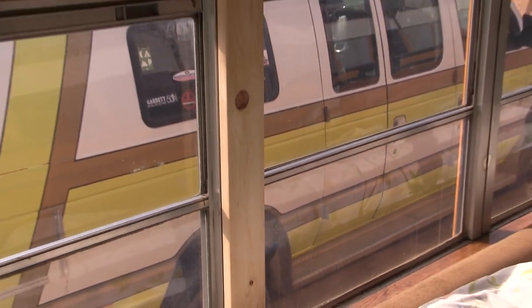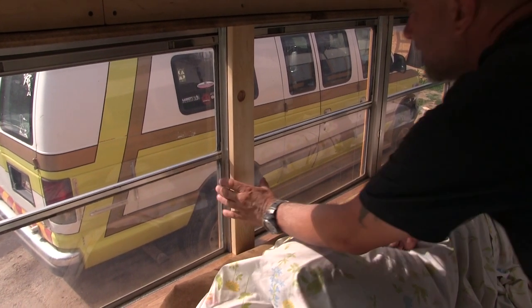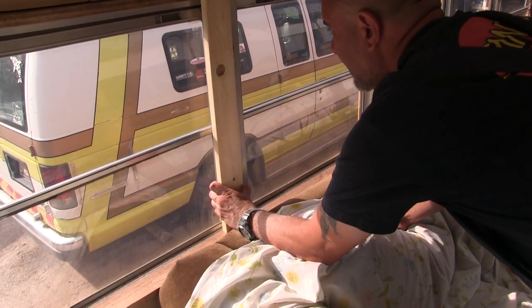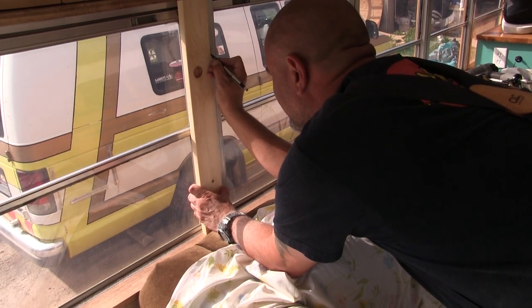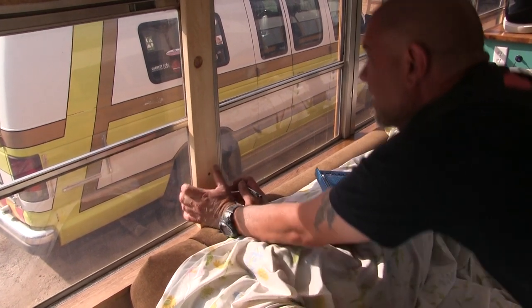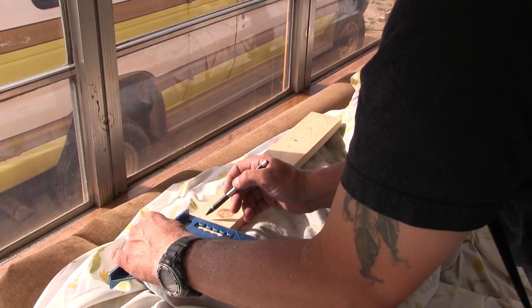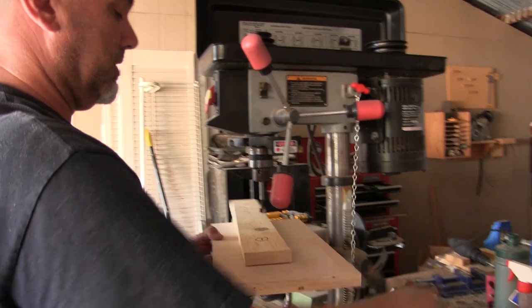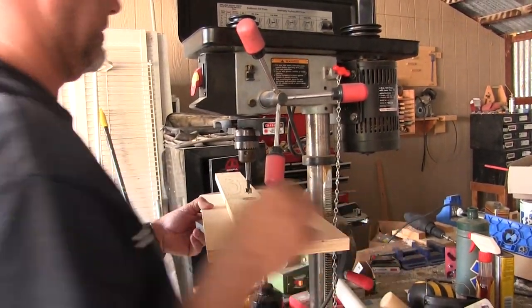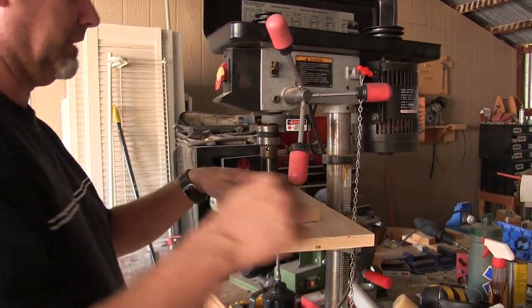So this is what it's going to look like there with the two brass things. This is kind of neat because I can go like this, marking where the screw holes are. That's where you drill a hole into it. In this case I'm using a Forstner bit, which is going to cut really nicely. If you want it to look really good coming out the other side, back your hole with wood - it'll be really, really clean. I'll show you.